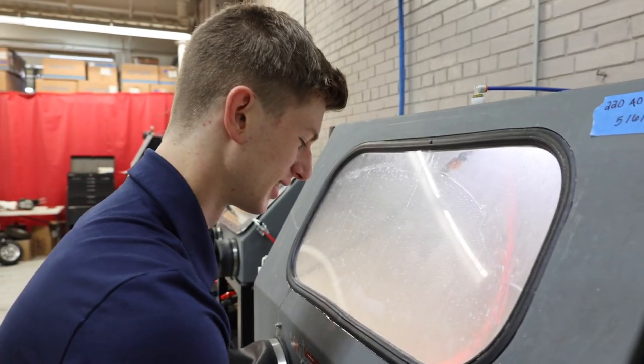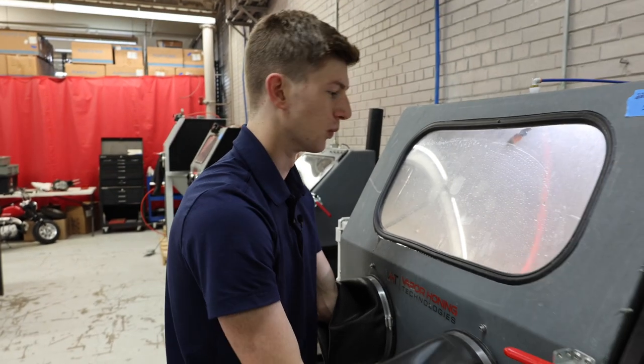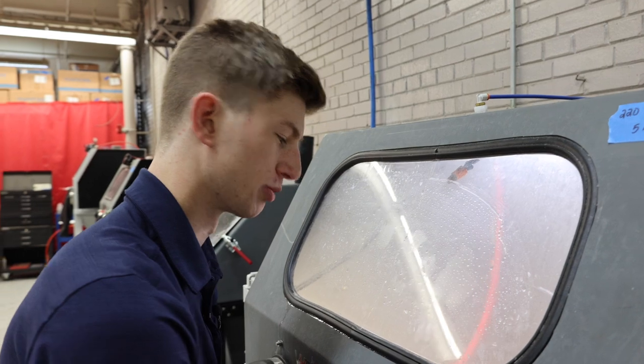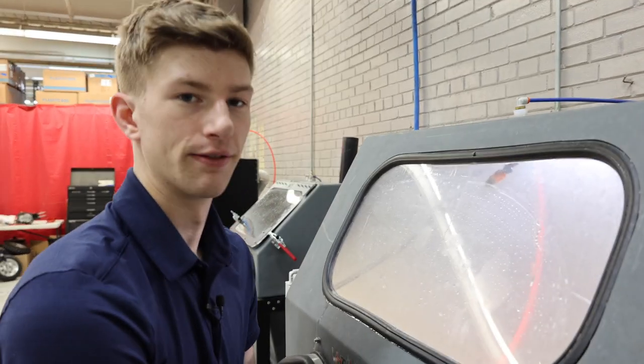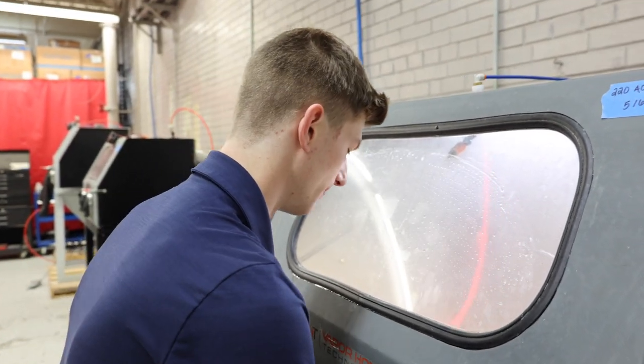Sometimes these things get hard to see in, but usually if you let the vapor dissipate it's a lot better. I did miss a few spots — that's just abrasive, a few places here and there. In total I've been working on this for about eight minutes. This gasket is actually coming off fairly well. These bearings are definitely getting some abrasive in them, so we'll see if we can clean those out. Before anybody says anything in the comments, these bearings will most likely be replaced unless they turn out perfectly fine. We always recommend removing or replacing bearings afterwards, because abrasive is very good at finding its way into areas you don't want it.